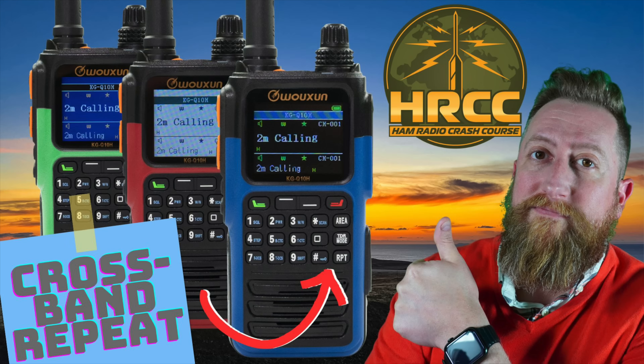After my first video review for this radio — mine had a different color, not this black one — I found, along with some other YouTubers like HamRadioDude, that this radio created spurious emissions on basically every frequency. It did not meet the FCC rules governing dirty radios. In a nutshell, if I'm transmitting on 146.520, the national FM calling frequency, this radio would simultaneously be transmitting on its harmonics higher and lower on that frequency — meaning while you were transmitting in one place, you were also transmitting everywhere else. This could create interference with not just ham radio operators, but first responders and multiple other radio services. A big no-no.